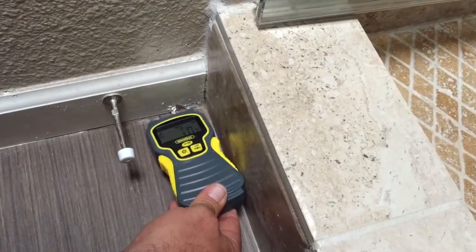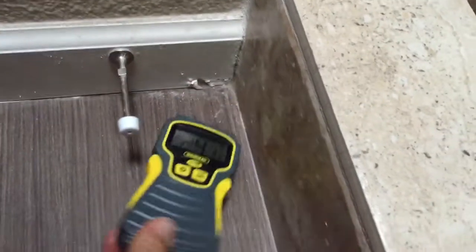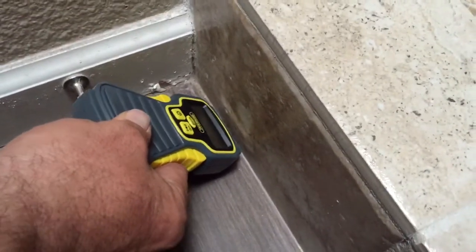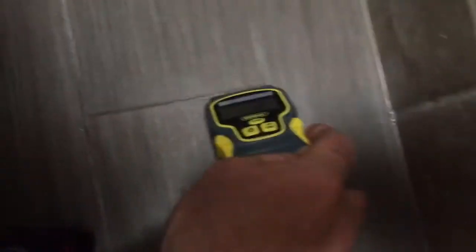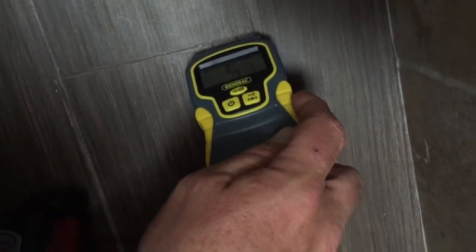In fact, in this little bit of time, it's beginning to peel a little paint here. We're getting readings in both corners, and we can also get a reading off the grout when we're on it — but it is not the same everywhere. For instance, we have virtually nothing coming out of the moisture meter on the grout here.